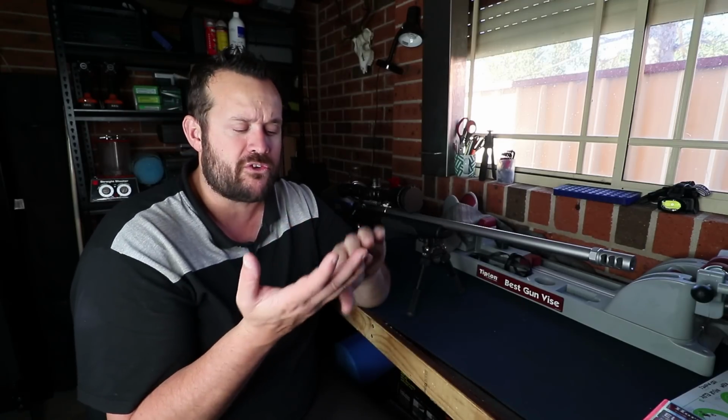Now you might remember on the 243, I actually have two APA Little Bastards. I bought them both in 6.5mm because that's all they had at the time when I bought the first one for the 243. I was thinking about getting a 30 cal later on. So what I decided to do was take both muzzle brakes to the gunsmith, and he reamed them both out to 30 cal. Now there was a really good article on Precision Rifle Blog about what the effects are of using an oversized brake on a smaller caliber. Now he had all this fandangled equipment, I can't even claim to know what it was, but they estimated that it's only 1 to 3% difference on using an oversized brake compared to a caliber specific brake. So I thought, why not? What I did is I just reamed them out to 30 cal.